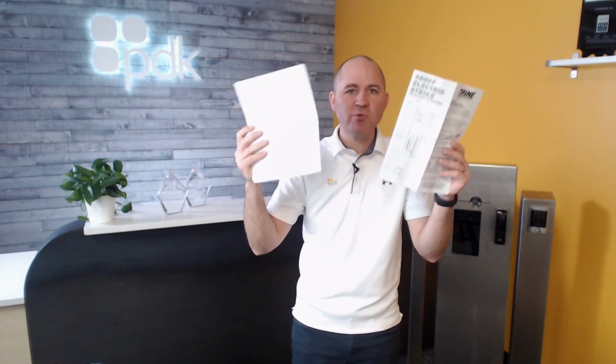you're using a mag lock, you could decrease that all the way down to a half an hour, depending on the size of the mag lock. So again, the way that you calculate that is by every data sheet that comes with every piece of hardware that you have. Pull your data sheet for your strike, for your mag lock, for your reader, and for your access control panel. Look at every single one of those, pull all of the amperage, and look at all the voltage, make sure that you're utilizing the right voltage, but then pull all the amperage so that you know I need to have a total of a half an amp provided for continuous duty at this door.